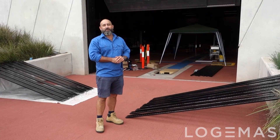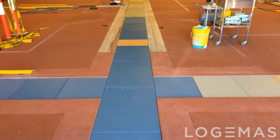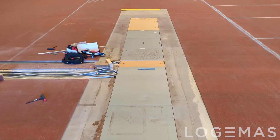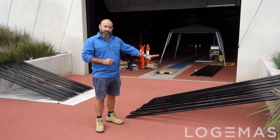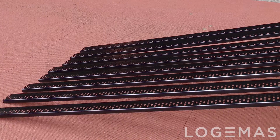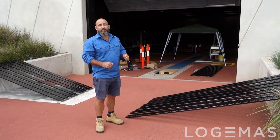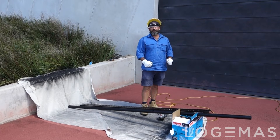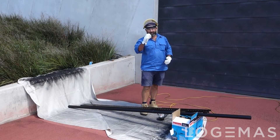Welcome back to Victoria University Footscray. Part one — AMTI installs are all complete now. We've got 19 force plates and dummy plates installed, leveled, tested, and running perfectly. Now we're onto part two: the Vicon camera installation. We've spray painted some cable trays that'll go on behind the custom brackets, and we've got our 50mm aluminium pipe over there ready to go. Let's get the hammer drill out, make some noise, make some mess and get the cameras on the wall. We've measured up the first rail at 1750 and the cable tray — it's time to get cutting.